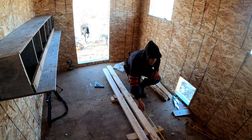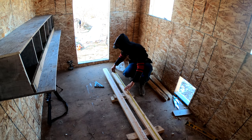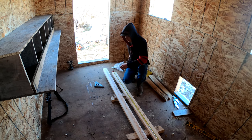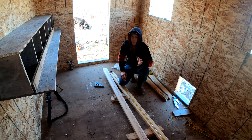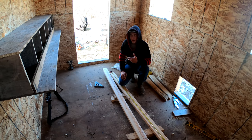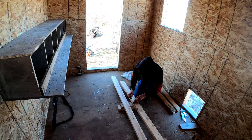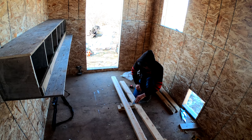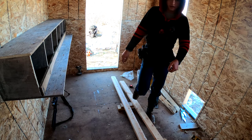Now I'm building the door — this is going to be a fully insulated, simple and easy-to-build door. I'm building this door an eighth of an inch smaller both in width and height than the opening I have. I'm going to cut 45-degree angles into both the top and side pieces for this door frame — it'll make it a little easier for me to nail them together. Then we'll get that situated and start insulating this door.